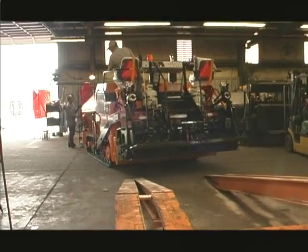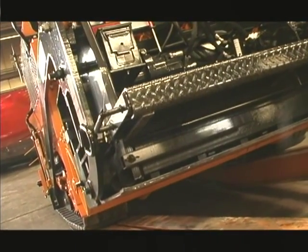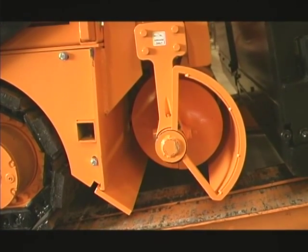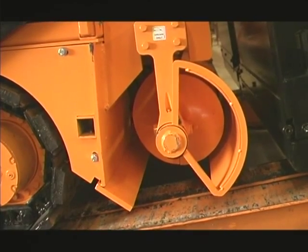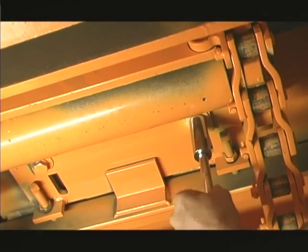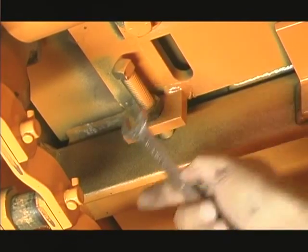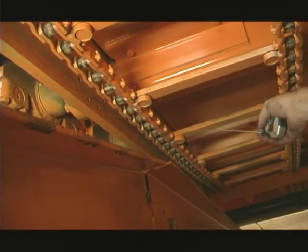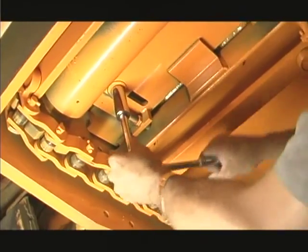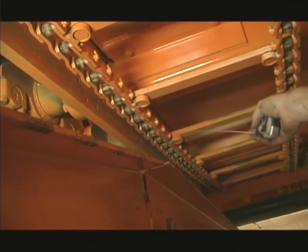To check the flight chains for proper adjustment, the machine must be run up on ramps to provide access to the roller assembly adjustments. Always back the paver onto the ramps. Because the cut-offs are low, make sure they are open and that the augers are raised before backing up onto the ramps. To adjust the chains, first loosen the lock nut on each adjuster bolt. Turn the adjustment bolts in an alternating sequence to adjust the chains. When correctly adjusted, the chains should not hang below the frame and should be one half inch away from the rear frame square tube. After the correct tension is set, tighten the lock nuts on both sides. Do not let the chains run more than two inches below the main frame sides under the machine.